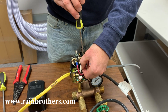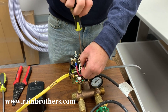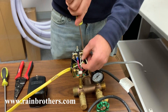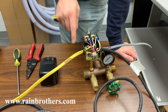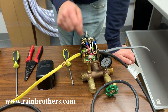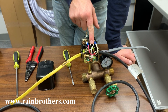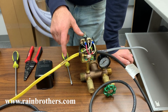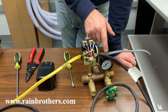This is the neutral leg coming from the panel. Now this is a 115-volt installation. On a 230-volt installation, it actually wires the same way. The only difference is that these two wires right here are probably going to be red in color instead of white. But with a 230-volt model, you're still only interrupting one of the hot legs supplying your pump.